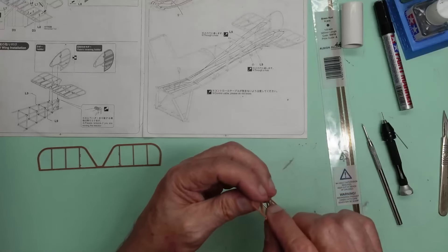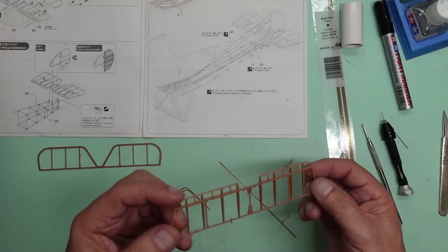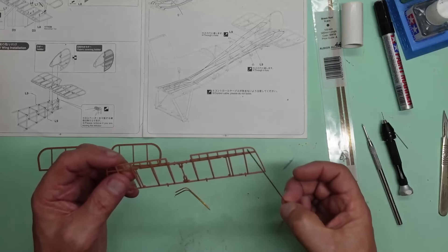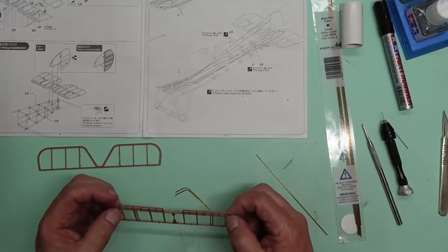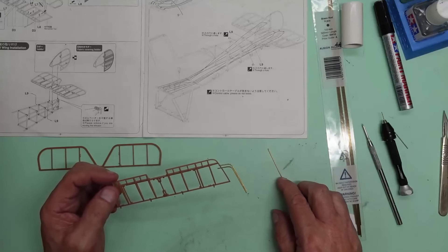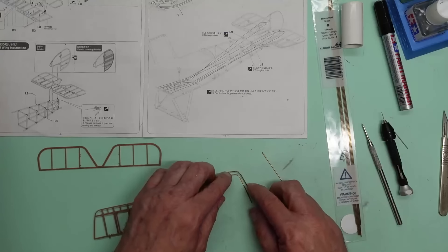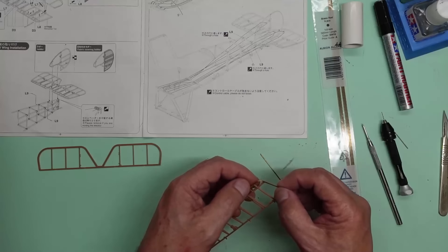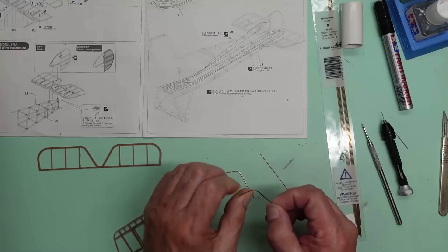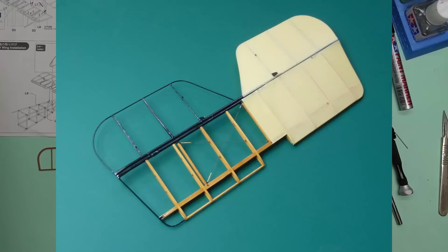Okay, so I've been sat here sanding this and I'm looking at it and I just don't like it. When you look at the real thing and you look at this, it just doesn't look right. So what I've decided to do is replace it with one millimetre brass. Remember, this is one sixteenth scale, so if I use one millimetre brass it'll be 16 times bigger - that's 16 millimetres, which is like five eighths. So that's probably pretty close to what they would have used. Looking at the model it kind of looks right.